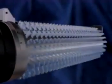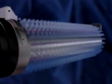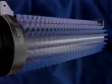Multi-phase insertion is the newest technology for inserting picks into the warp shed. This system uses a series of 4 air jets on a rotary drum to reach a pick insertion rate of up to 2,800 picks per minute on basic plain weaves and twills. Due to its complexity and ability to do only very simple weaves, very few multi-phase weaving systems are in use.